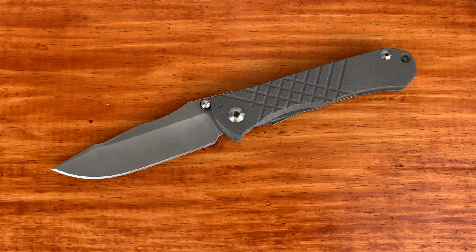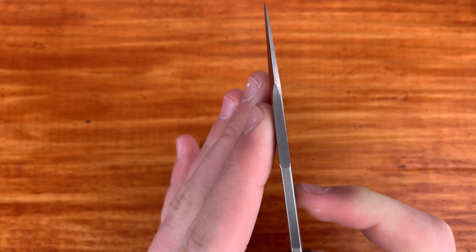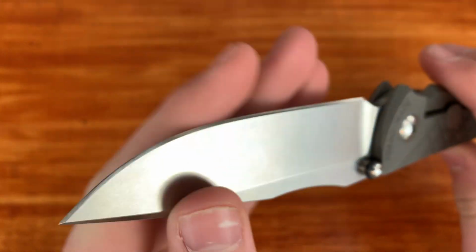And I really feel like if a company like Benchmade or Cold Steel made a knife like the Umnumzaan, it'd probably be around 30 thousandths behind the edge. And so I'm glad that Chris Reeve Knives realize that knives that are thinner cut better, and that's what knives do. The stock thickness on this is a little bit thicker than most of the average knives that you use, and so if you look at my angle, I did sharpen this knife. It is a little bit lower than the one from the factory.